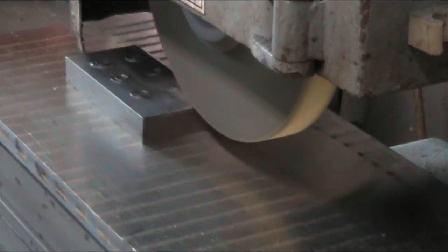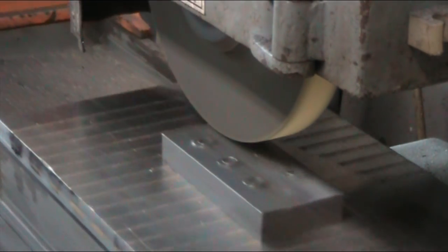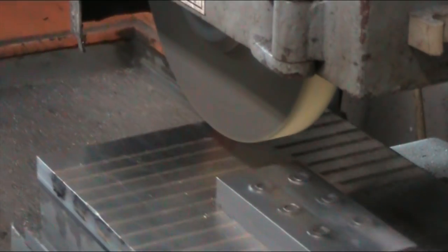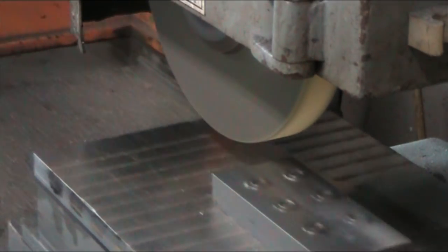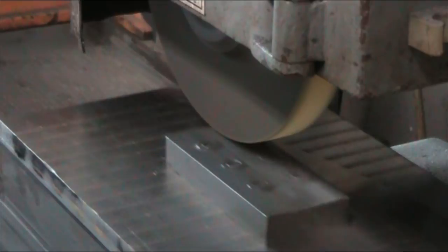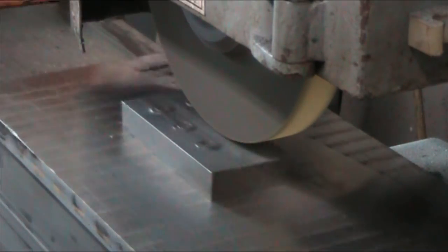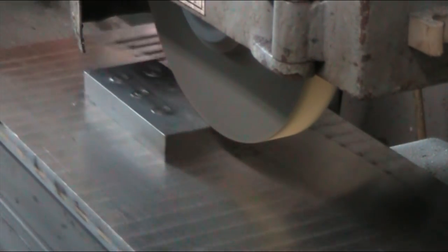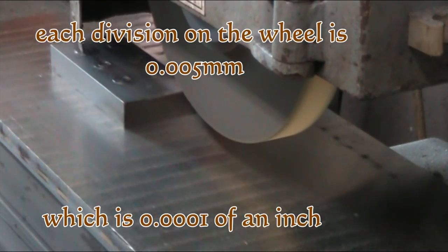Engage the feed. Now this is a hydraulic machine and it's been sitting. It's also very cold outside, although there's a heater in here, it takes a while for it to warm up. So now we're dropping the head down onto the work. Gotta be real careful so that the glue doesn't heat up and release. I can barely hear it touching, so I'm just taking it in a few hundredths at a time in order not to pull the washers loose out of the holes.